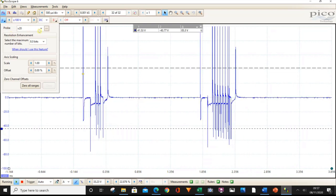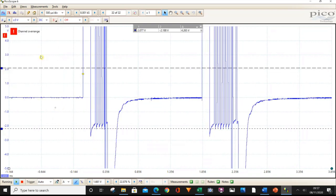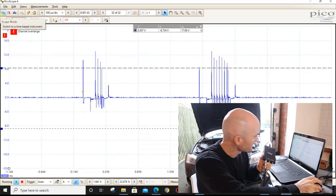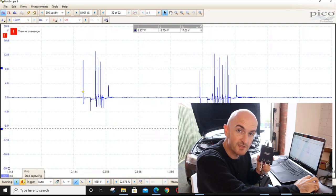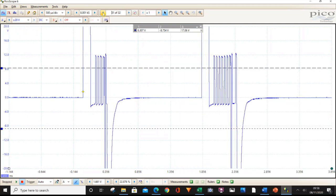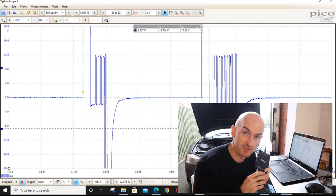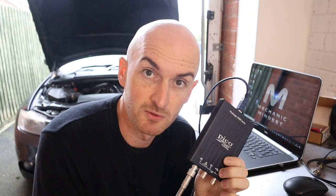We do have some measurements there. Let's remove the probe settings and go to 20 volts. We can see it's not very happy with what's going in there. Pausing and scrolling back through — the scope is not picking up what's coming in, it's simply not capable of measuring that high voltage. That's exactly why you need one of these. It was okay this time, and I have exceeded the input voltage of this scope a number of times and it survived. They do engineer them to withstand a sustained voltage above the maximum for a short period — but if you connect it to a permanent 40 volts and leave it there, I can't see it lasting very long.